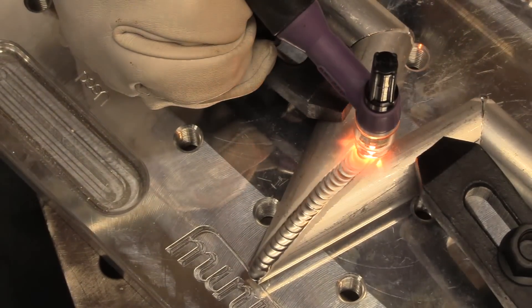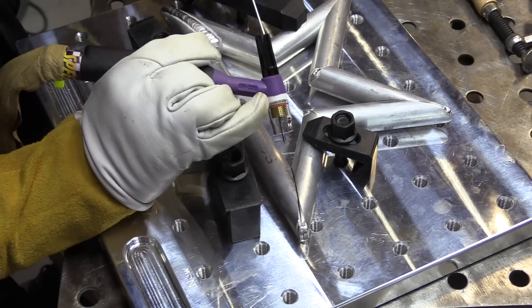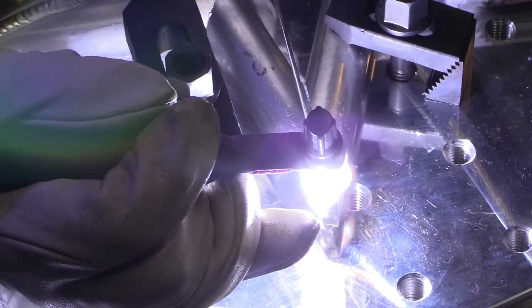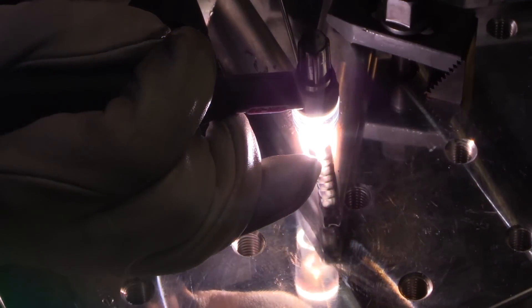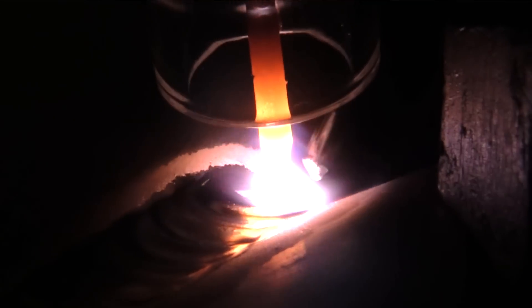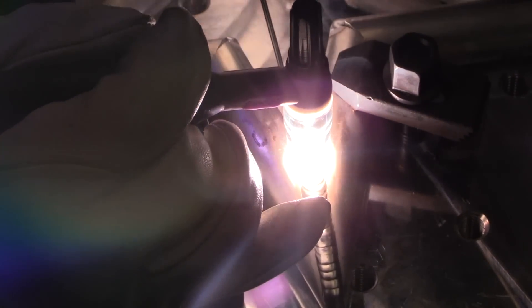Another cool thing about a small fixture plate like this is it's easy to rotate the part around. I could have clamped this down to the table, but then I'd be crawling all over it — a small plate like this is really easy to reposition. I'm not pulsing the pedal so much that I'm letting off to where it completely solidifies; it just lets off enough to give me a second to not overheat things, because sometimes your filler rod won't be ready and you're fumbling around with your TIG glove. I'll come in and weld these tight angles to sew those up after both sides are welded — they take more heat. That's the reason I'm traveling in this direction: it takes a lot less heat out on that tip and a lot more heat in here in this crotch, so it gets things heated up really nicely.